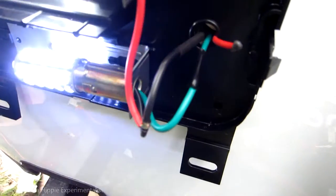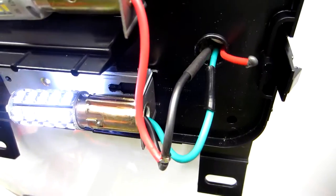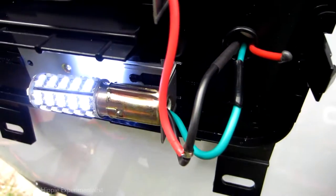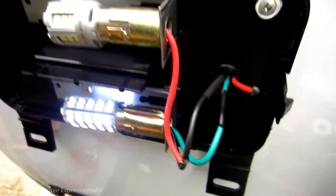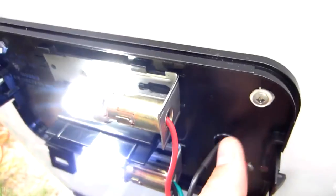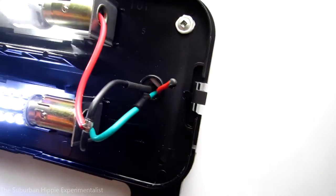Here's the new light fixture installed. It was kind of a pain because the wires are very short on the inside. There's that red liner material — what they call red fur — so to get to these wires it's not really easy. I had to tear that red fur off to access them. Luckily I was able to solder them, so I put shrink tube here, here, and here.